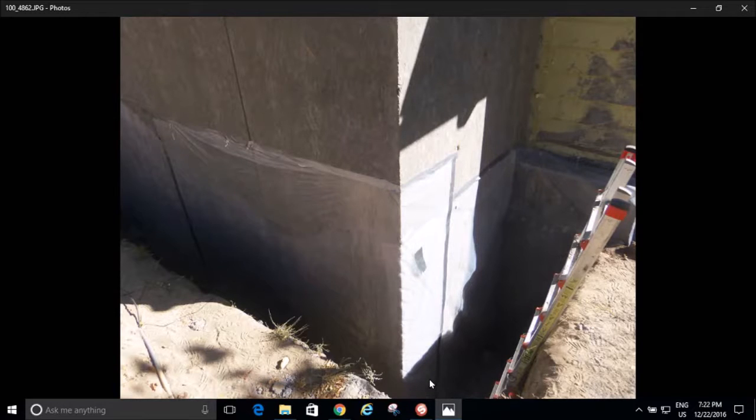And they came out, I ordered 24 yards of concrete for my walls. And I didn't quite use it all, but luckily I ordered heavy like that because I did have a blowout. And when you have a blowout, then it's just more concrete that it takes to fill your forms up. Now, luckily I did not have a complete, total, 100% failure because then it would have been really bad.